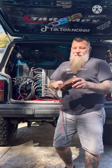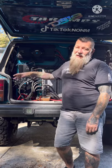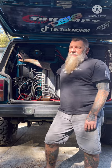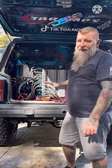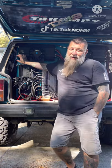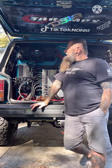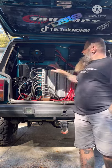Today when I checked everything at volume 32 with the bass knob all the way up, all the amps were in clip — the clip light lit up. A good way to find your clipping point is to probe each amp as described. If you don't have a clip light, use a DD-1 or an oscilloscope to find the clipping point. Each amp was reading anywhere from 121 to 123 volts and the clip light was on. Normally I set them at 115, but today I went conservative and set each amp at 113.5 volts — a nice safe zone.